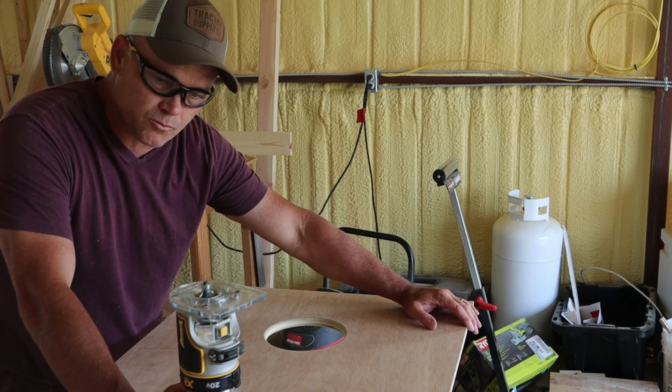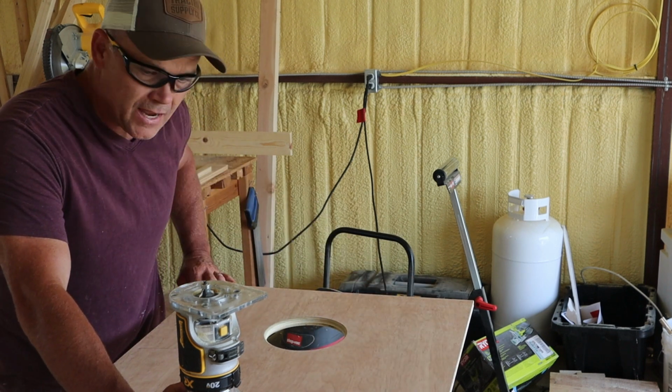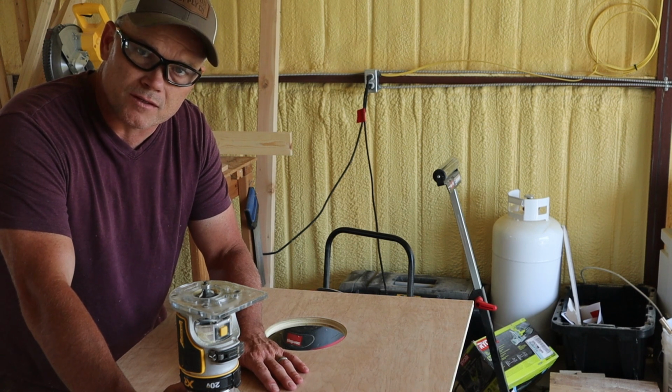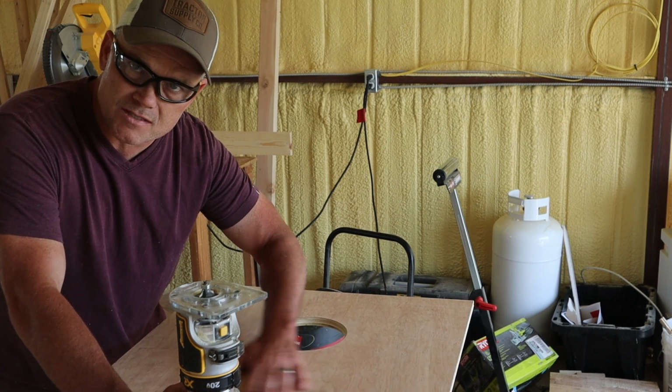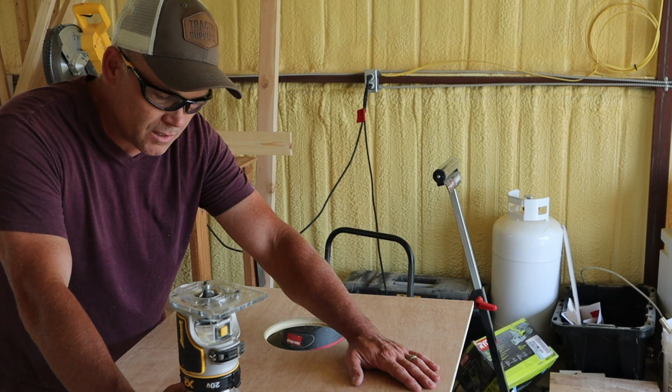So I'm gonna round over using the same quarter inch roundover bit. I wanna round over each of the sides, all four sides on the top as well. And that board will be ready to stain at that point. I take that back. I will do some sanding. I wanna sand the top surface all the way to probably 220.